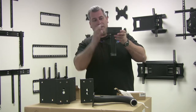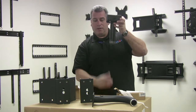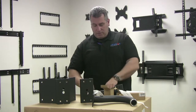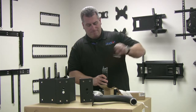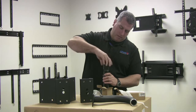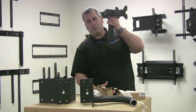When mounting a camera from a high ceiling using this box, you can use a number of Crimson pole mounts to extend it down. Typically in retail by the cash registers, you've got to go down quite a distance. Crimson has a number of different lengths of poles and couplers to make the poles different lengths. None of their pipes or threads are tapered, so when you use a coupler the threads go all the way up, you don't have any exposed steel, and it looks nice and smooth when the longer pipes are connected together.